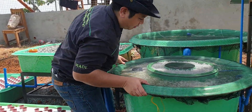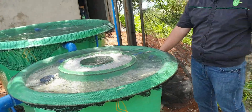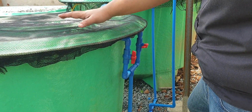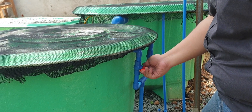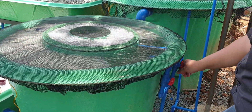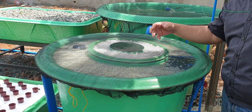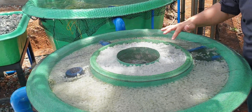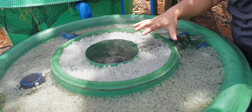After that it goes into an MBBR, or moving bed bioreactor. The filter is very easy to maintain. This air valve provides air to the outer part of the MBBR. During maintenance, we turn this off so the MBBR stops bubbling, then divert air to our static media compartment. The static media starts to bubble — the media is still new so it's still white.